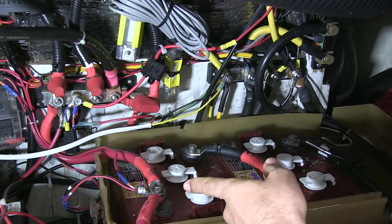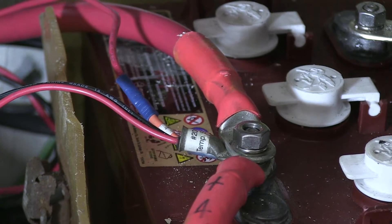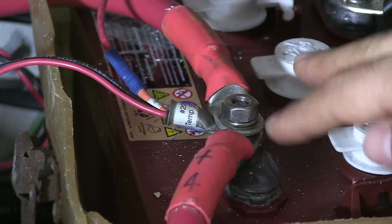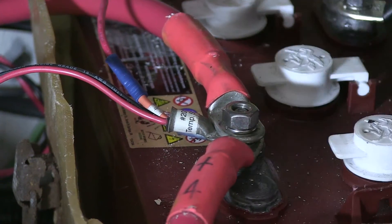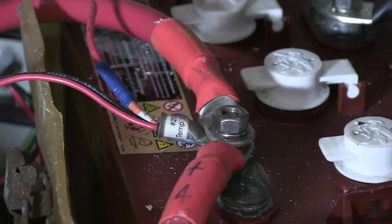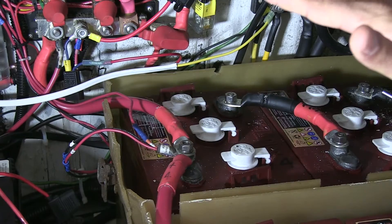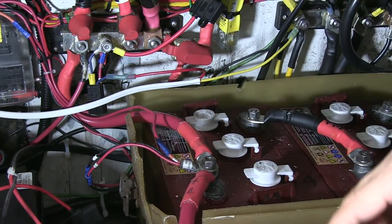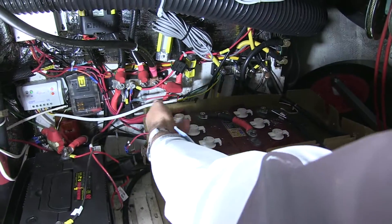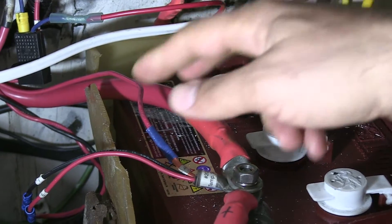The stacking of terminals is essential — it's a little bit like a pyramid. You put the larger blocks on the bottom, and as you go higher and higher, they're smaller and smaller. In this instance, you can see there's a large gauge lug, and in between that you've got smaller gauges that are impeding the current and creating resistance between the battery and the larger cable, which feeds your positive distribution for the whole boat. An easy fix would be to undo this connection and always stack from largest connector to smallest, so that a gauge 14 wire is not carrying all the current going through this large gauge wire. Also, this connector that runs your external regulator is actually unfused, so it absolutely must be fused.